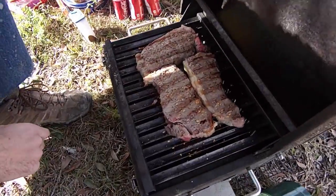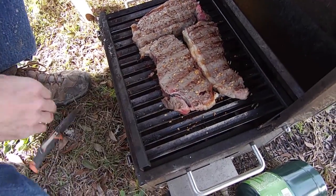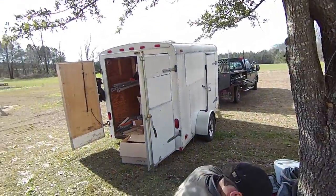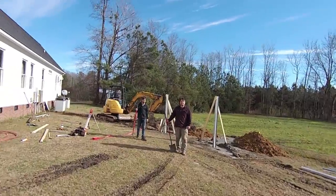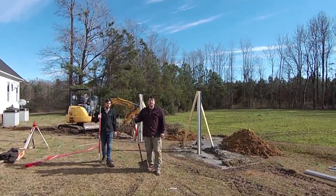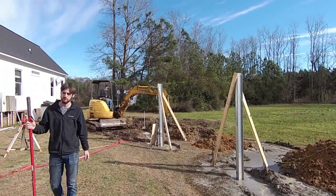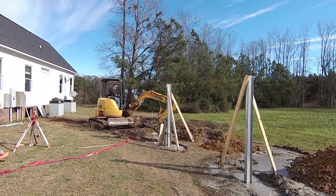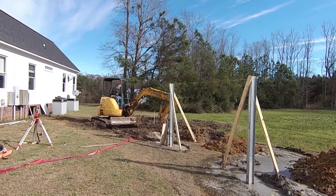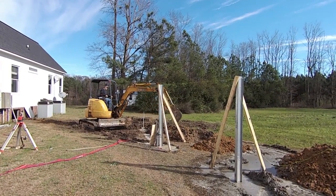It's the Prepper's Kitchen once again. Got us a little different grill here, folks. We're mid-install. We'll have more video of this job. We're going to have a little over 3KW — a 3,300-watt solar array going in, 12 panels, Cineva 275s, and it's going to be feeding an Outback FM80 charge controller and an Outback Radian.